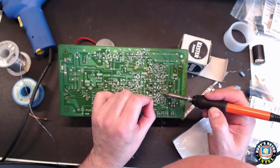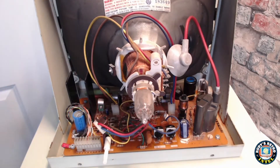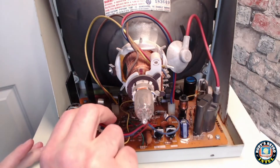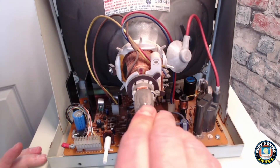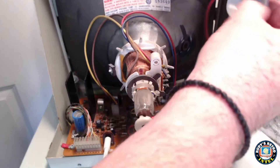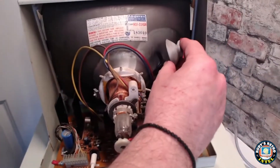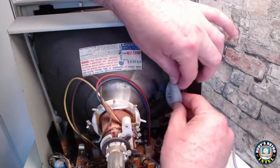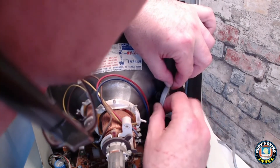All the capacitors have been replaced — this is the last one soldered in. Remove the excess wire, clean it up, and put it back into the monitor. We go back to the phone photos to review where all the cables go, ensuring everything is plugged back the way it was before we pulled it apart. That piece goes on nice and snug. Use pliers to re-pinch the connector and put it back in. I had a bit of trouble because the rubber suction component kept flipping back, but eventually got it in.